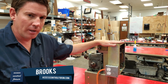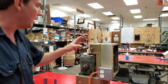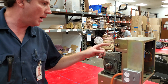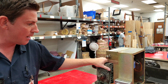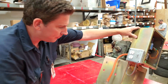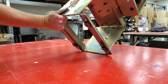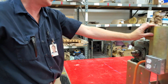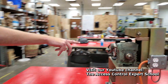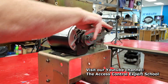So we have a safe high-voltage gate operator electrically. Now let's talk about mechanically. We don't have a good chain as yet, so I'm going to put a good chain on there that has less grease than the one we had. We know our gear reducer has a little bit of a leak, but that's okay. If you take a look at the bottom, we've added some LRF support, which is little rubber feet. Danny, who's behind the camera right now, got the motor and the gear reducer on, and we have the belt aligned.